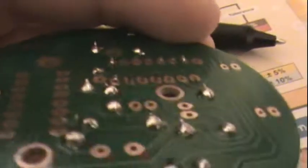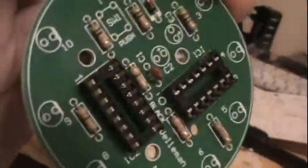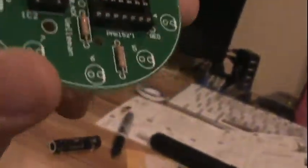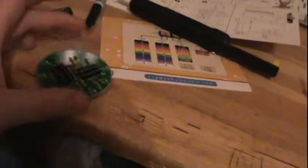I know I heard some people say when you put these sockets in, it's best to bend one of the corners, or two. I like to bend all four, just in case. So I got the socket in — I have to solder it though. I still gotta get the other one in too, so I'll check back with you guys after I've soldered both in. Okay, one socket soldered. All right, that last socket was a feisty one, but I got it in anyway. Now both sockets are soldered into place. I like it when I can put these in — these little sockets are kind of neat, because then you can change a chip out of them and replace it if you need to, instead of having to unsolder the whole thing. That's what I like about these sockets. So yep, got the sockets in.